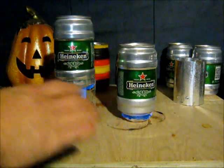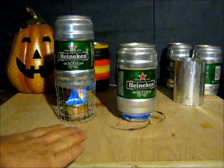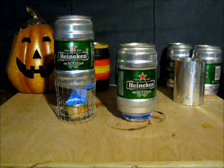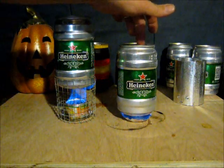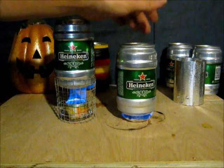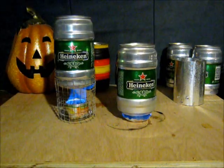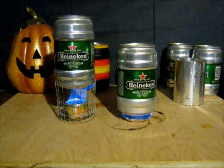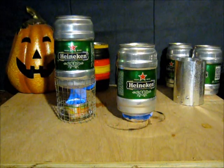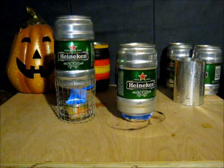But just an experiment. And this one over here is just a single wall little tea candle stove, but it's made of tin, not aluminum. So it's very sturdy as far as strength goes — I don't think it could be crushed. But it's still small and could be wobbly. It may be too wobbly to be used for anything. And it requires some kind of priming tray to get it going because it is tin. The tin metal takes a long time to heat up and hold the heat in, so that's why you need the priming tray.